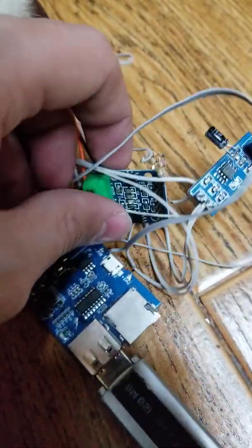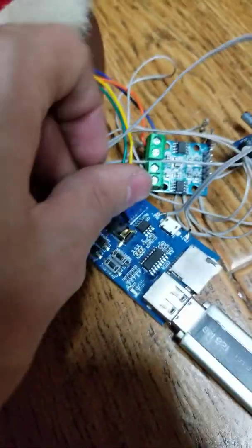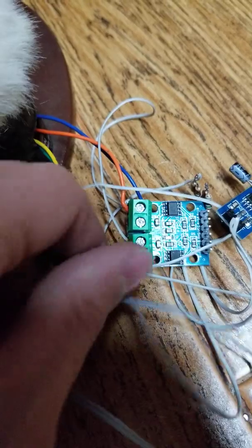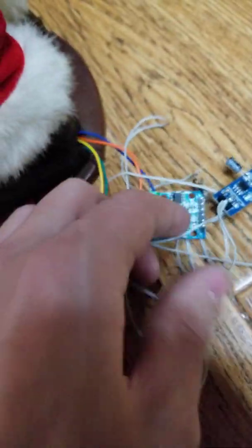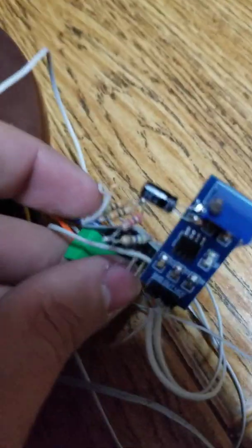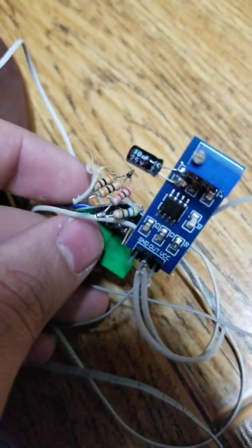John Rigg said there was a way to make a motor actually go in reverse with one single pulse, and he pretty much did it — I did it too. You have to do a few bridges here and there and put a 2.7K ohm resistor. In this case I didn't have one, so this is just a bunch of resistors trying to reach that value. Thankfully I got to that value — it's even a little higher, maybe 2.8K.